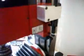Okay, let's go back to the process of now installing that top bracket. Okay, having now temporarily fitted the handle and carefully lowering down the head, having released with one hand and kept the other hand on the head to take the weight of the head, I've lowered it down. Once lowered down, you can now see that centre of fixing screw is going to mount where the original top stop was.